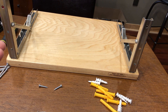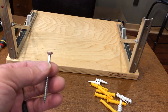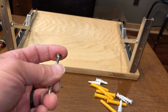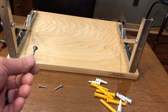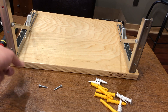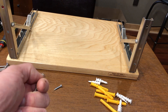The shelf has three holes, so there are three fastening points. I might just try the provided screws because of the chrome head — I don't have chrome-colored screws, just brass construction screws. Since there's only a span of 16 inches with six screws all on studs, even if one and a half on each side hold, it'll be good enough. The most important screws are the ones at the top because of the pulling forces, whereas the bottom screw, as you apply downward force, will be more of a compression against the wall.